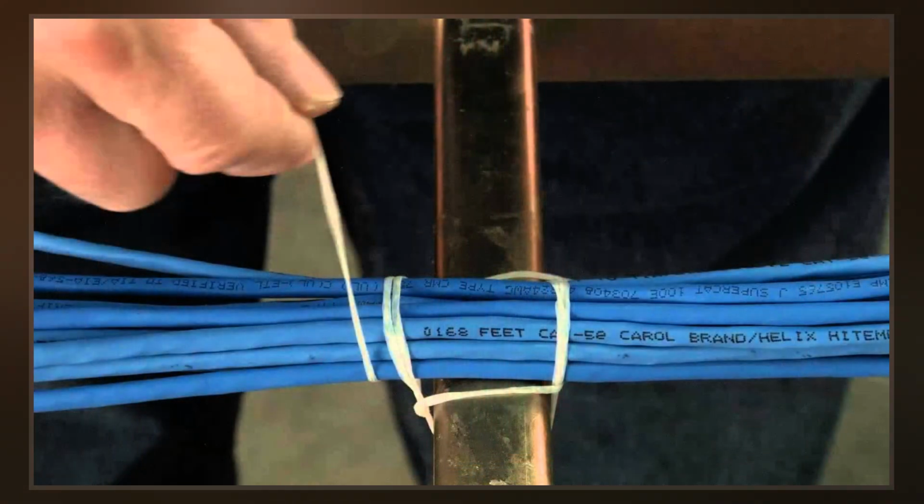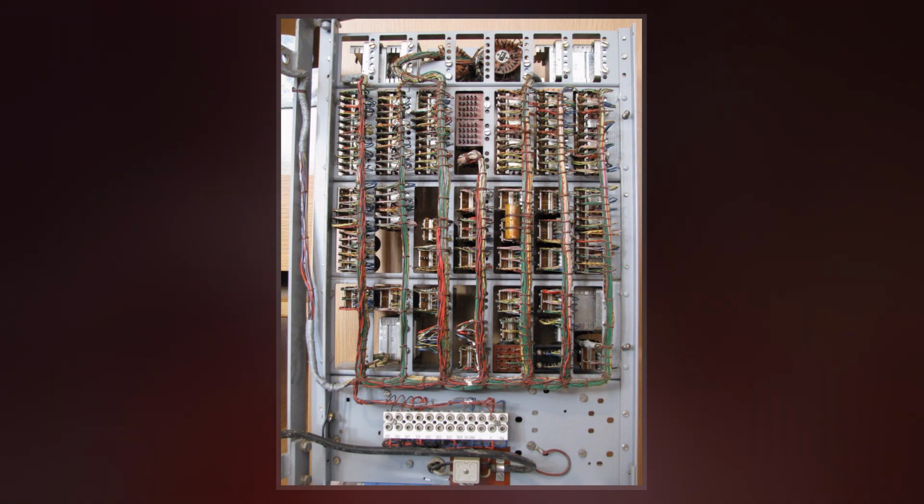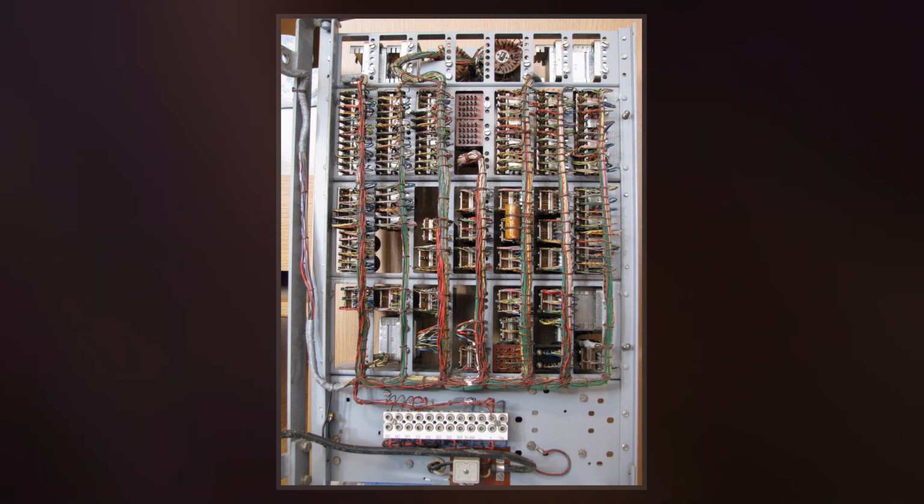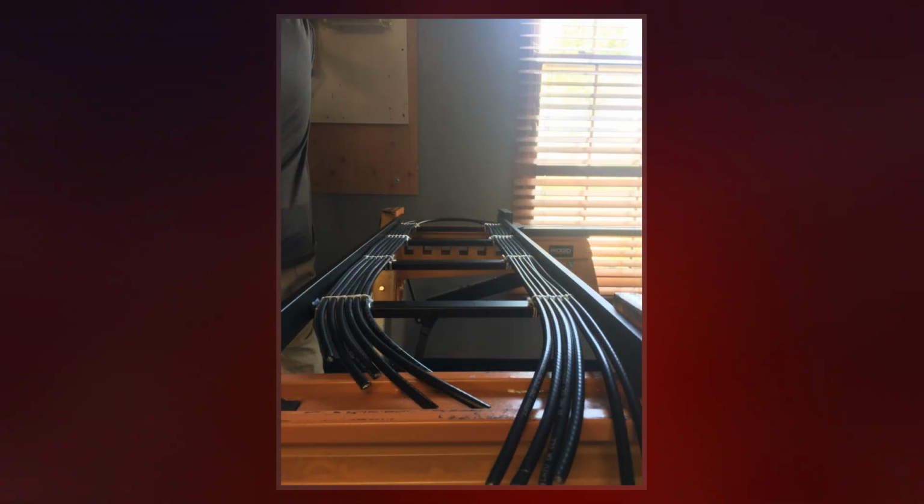Cable lacing uses a thin cord, traditionally made of waxed linen, to bind together a group of cables using a series of running lock stitches. Flat lacing tapes made of modern materials such as nylon, polyester, Teflon, fiberglass, and Nomex are also available with a variety of coatings to improve knot holding.